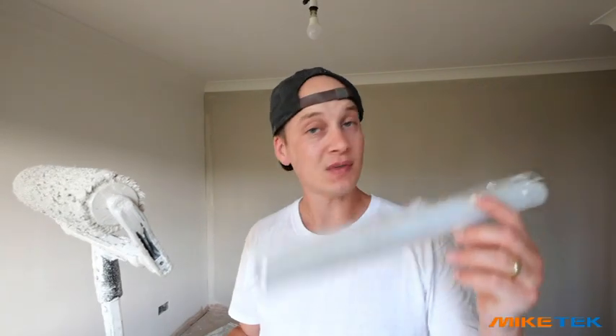I've painted all three walls, now we're moving on to the feature wall. A little tip: I've got the roller full of paint, so I'm going to wrap it up in cling film nice and tight. That means once the paint's dried on the other three walls you can still use the same roller — it'll still be fine instead of washing it or throwing it away, which is a waste. Wrap it up tight and it'll stay fresh for three or four hours, or even overnight.